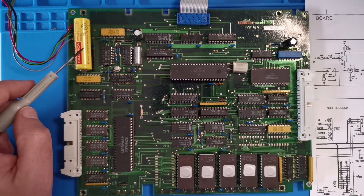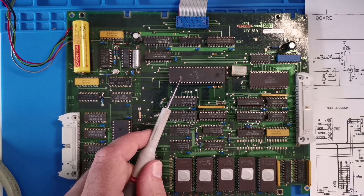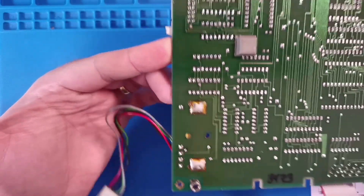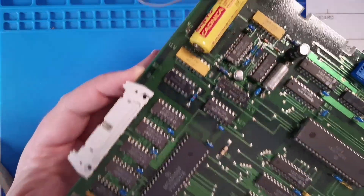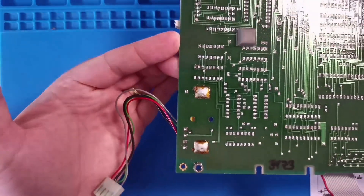This is the battery we're going to remove. This is an interface chip, this is the main processor which is a 6802, this is the program memory, and over here are the two RAM chips. On the side of the board it doesn't look as if there's been any change to that circuitry, so I do think it's just a case that this battery was fitted incorrectly at some point during a repair or calibration.